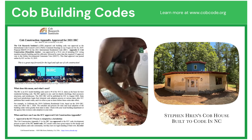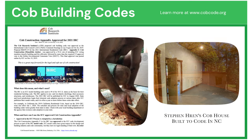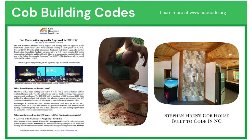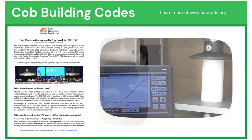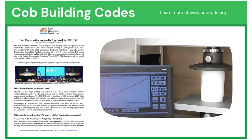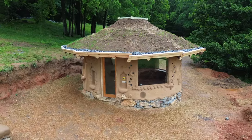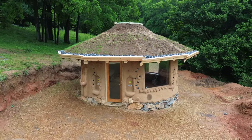As of 2021, there's now an appendix to the International Residential Code — used in 49 out of 50 states — that makes building a cob house to code possible. Part of the requirements is creating four-inch cob cubes that are put through a compression test, which provides more scientific analytical data to ensure you're creating the strongest mix possible. This is especially important when building a load-bearing cob house where the cob walls support the entire weight of the roof.